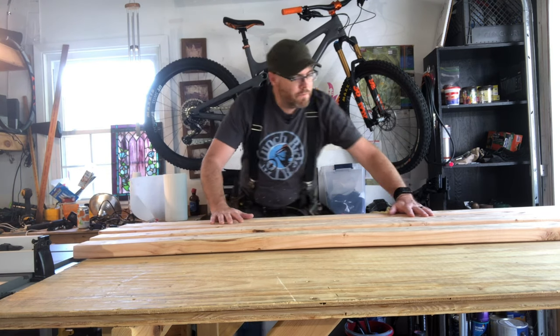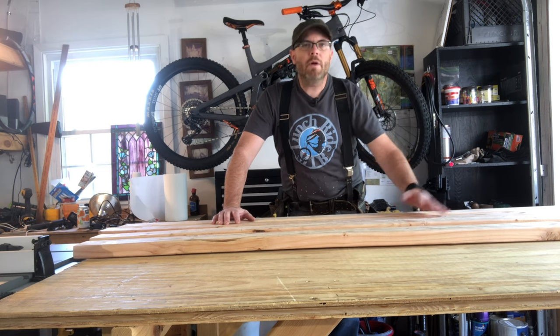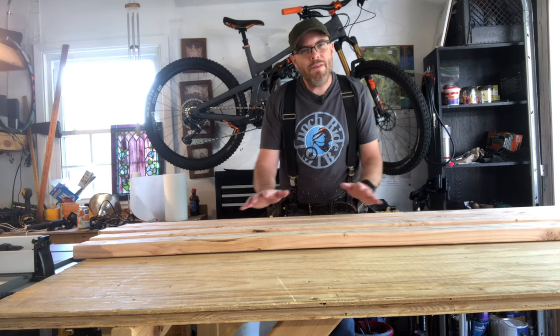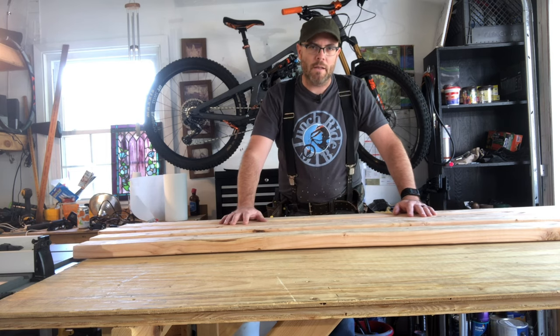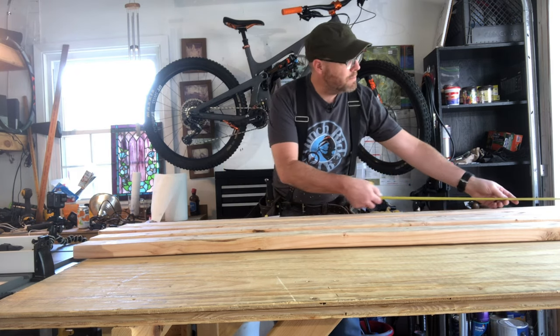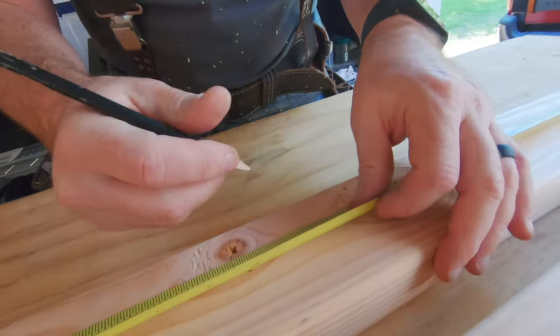To make the most efficient use of the boards, I've made a layout of pieces to cut in the plans. I'm going to mark out the boards to make sure I don't waste anything, but I don't want to cut everything until I'm sure the largest and most important pieces are cut correctly — otherwise I might wind up with a shortage and have to go back to the store. A good rule of thumb: cut the longest piece you need from the shortest piece you have.